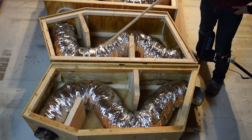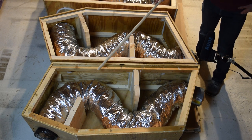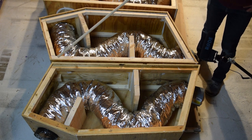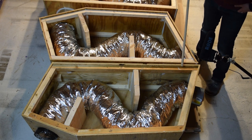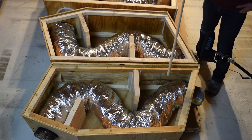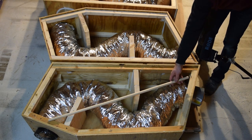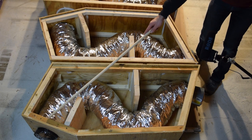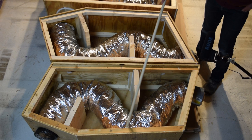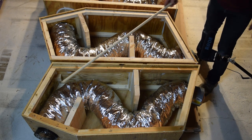Before insulating, here are the two boxes going into the live room / vocal booth area. They're on a slanted angle because of the pitch of the roof being so close to the ceiling — I had to make these very complex boxes. But once again it's the same idea: stop the direct sound path from one opening to the other so sound has to travel around the baffles inside the box to come out.